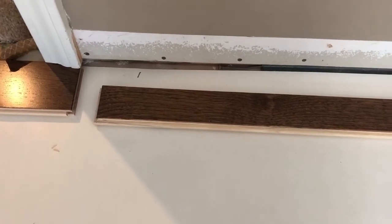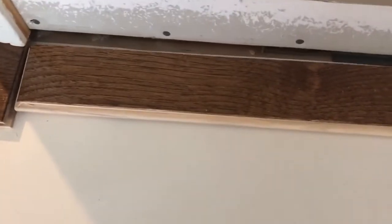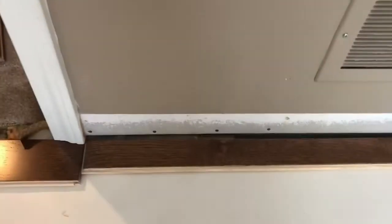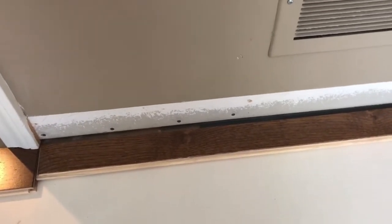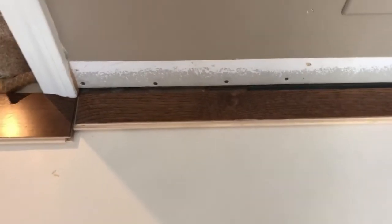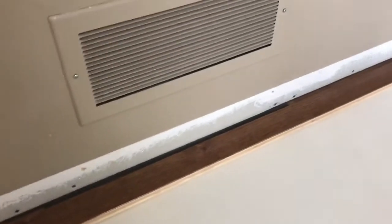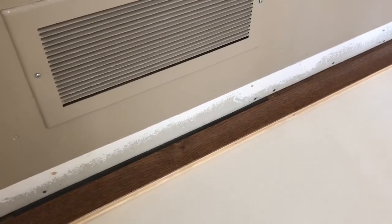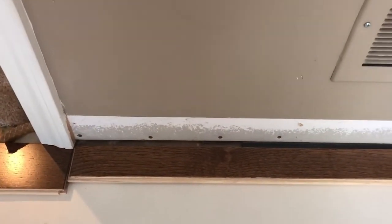Anyway, so we got to do that up against. Got to leave a gap. Just the wood moves just like in furniture, so we have to leave a gap around the edge, and they recommend 3/4 of an inch. In this case, it'll fit underneath the drywall, so I've got a 1/2 inch there, and then we've got, of course, the trim will have to go back on, and the shoe molding, that gives us an inch. So we've got some room to move here, to play with.